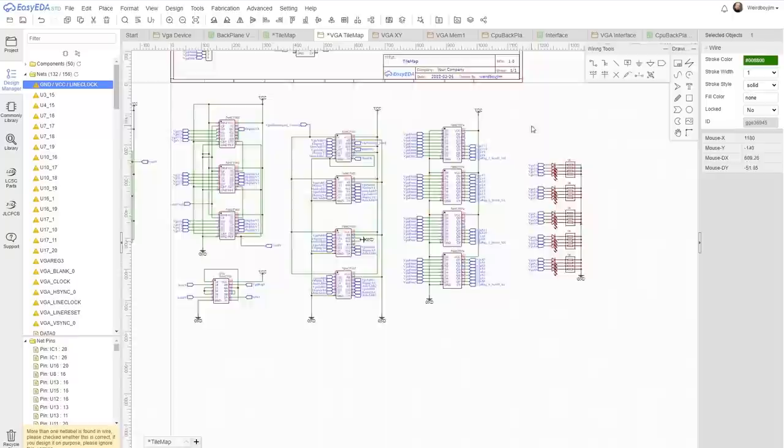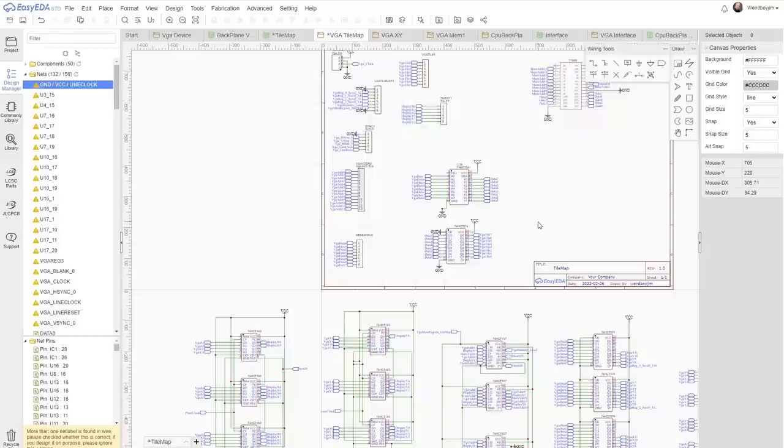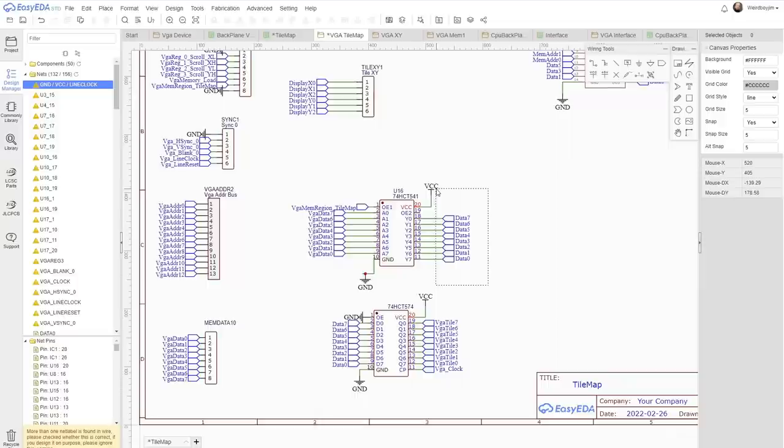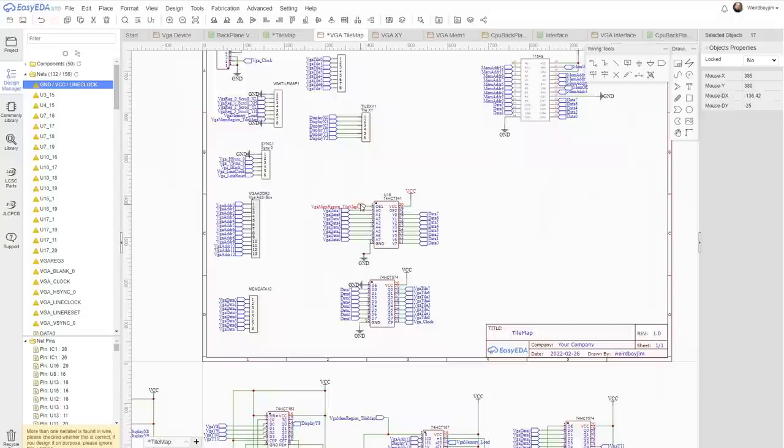Right, so the 574 is always outputting. It needs the VGA clock. Output enable on the line driver, that's conditionally taking data from the main memory bus, outputting it to our data lines if and only if a write operation is in place. So that actually connects it to these inputs up here. That's good.